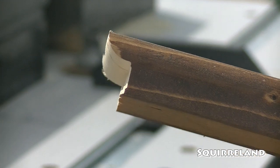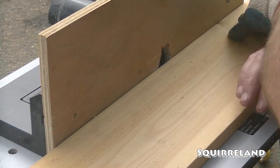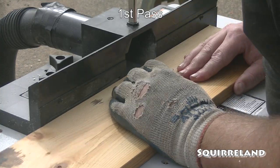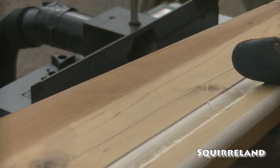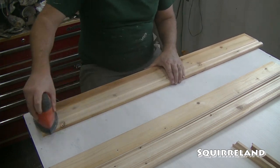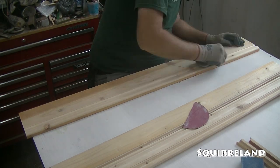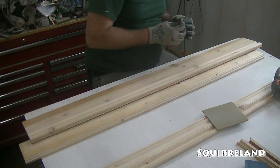This cut is the positive shape that will fit into the negative space of the side trim boards. Next, I'll be working on the multitude of pieces that will make up what I designed for the crown molding. The crown molding will consist of two parts: the first part will be permanently attached to the panel, and the second part will be removable and make the storage of these panels more economical. This large board is the piece that will be permanently attached to the panel — the top half of it will be covered by the removable section, so I only need to detail part of it. Before I apply the wood stain to this, I'll make the rest of the trim boards that I'll need and then stain and paint all of them at the same time.